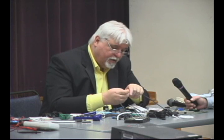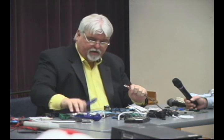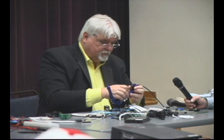And I'll put it in here and slide it in. You see, I've got my little tip of my conductor. So I'm going to take my compression tool and go ahead and compress it again. And this one needs to be compressed a little more, so I have to adjust it so that it will compress it all the way.